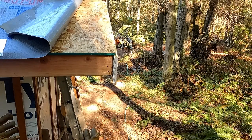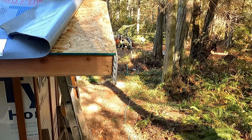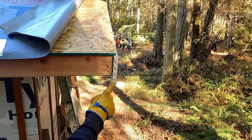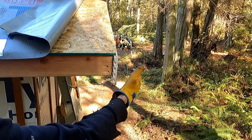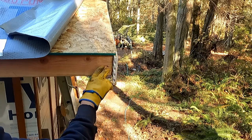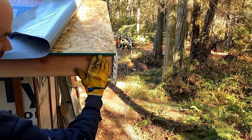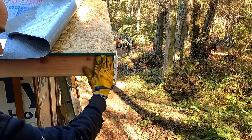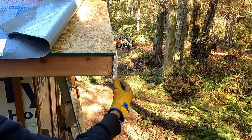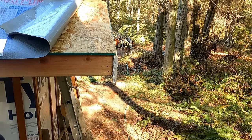The goal is that I'll have a perimeter all the way around the roof edge of this structure that is impervious and rot-proof. First thing I'm going to do — you see this profile is kind of screwy. If they expect you're only going to see one side of it, they call this door jamb, so you don't see the back of it. To save material it's not solid — it's got these grooves in it. That doesn't suit me because if I butt a piece up here I'll have these holes. No holes. So I'm going to make a half-lap joint and cut this back to where it's solid, so that when my new piece butts up here it'll have a solid glue seam all the way down with no holes in it.